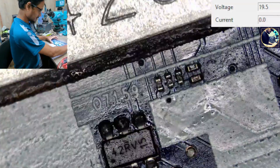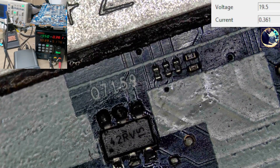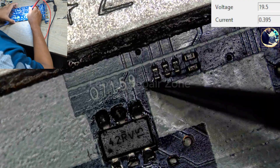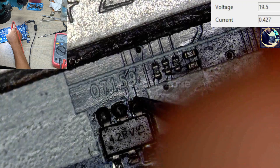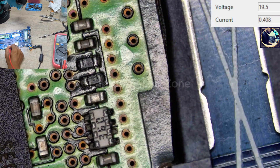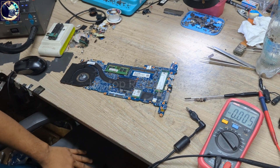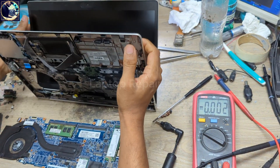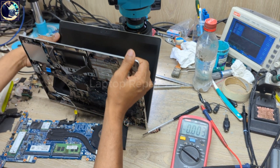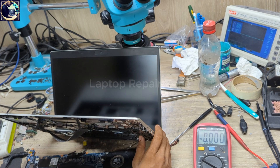Okay, done. Let's plug in again, and as you can see it's taking 0.4 amps or something — that means our core voltage is present now. Let's check this voltage again — we have 1.2 volt, and the gate voltage is also 11 volt. We have the coil voltage on this coil now. We need to wait a few seconds because it will restart one or two times.